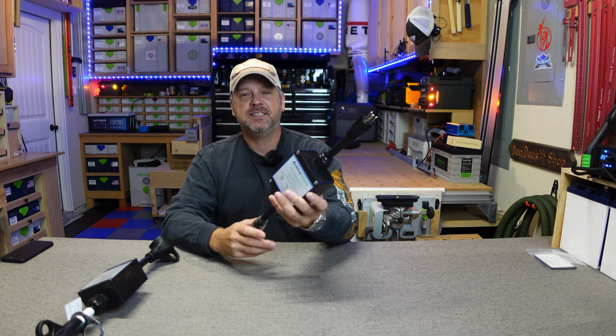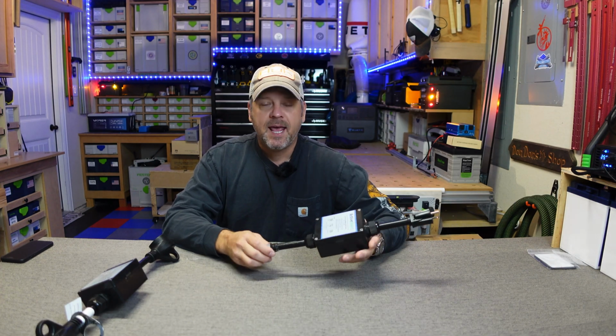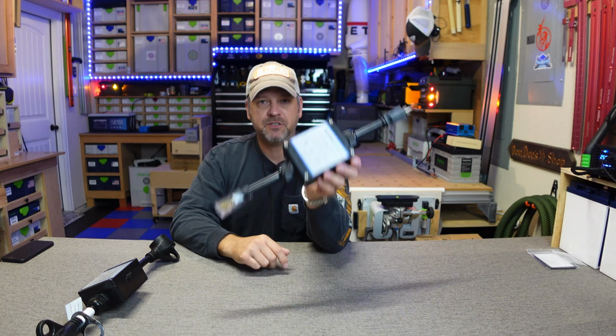For this test, guys, I just want to show you what this thing does. So I've got a 5,000 BTU window air conditioning unit, and I'm going to start it up, and I'm going to plug in a watt meter, and I'm going to show you what that air conditioning unit uses in terms of startup power without this installed. Now, I'm going to be trying it on an 800 watt Sportsman generator. I've done a couple of videos way back in the past where that generator will actually start and keep my air conditioning unit running, but it's difficult for it to keep up with that initial surge. That'll give us a baseline.